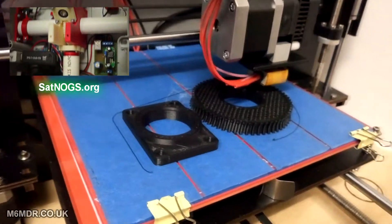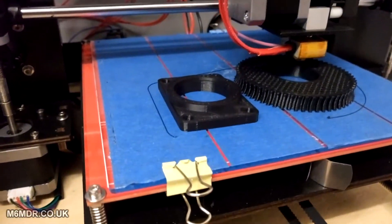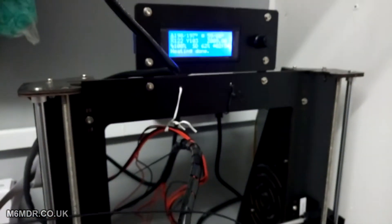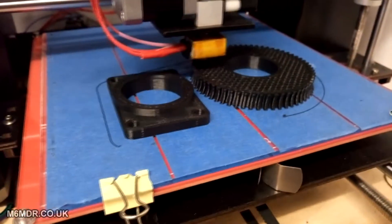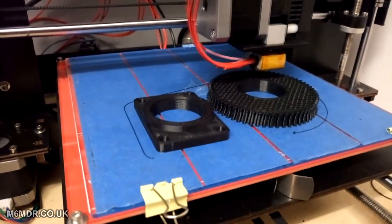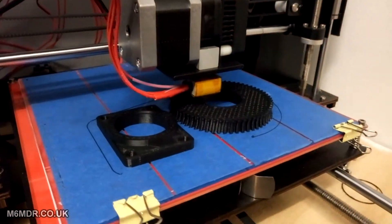I've been busy playing with the CNC machine. When I came back, I checked the gap and you could get a lollipop stick in there, whereas it was set really well before. These things are affected by moisture and temperature. I was surprised by how much of a gap there was. Nobody's touched the machine, nobody's messed with any of these adjusters. It must have just contracted or something.